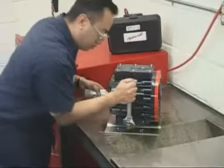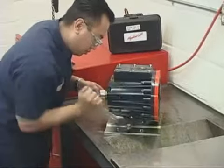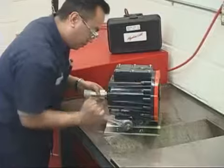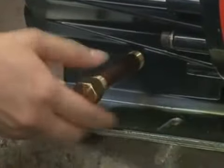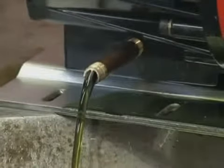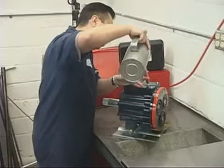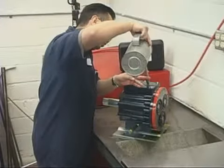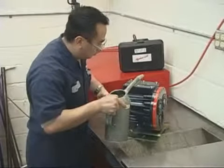To flush the contaminated oil from the hydraulic end of the pump, first remove the oil fill cap and the oil drain cap and allow all oil and contaminant to drain out of the pump. Replace the drain cap, fill the reservoir with oil, kerosene, solvent, or other appropriate fluid, then manually turn the pump shaft to circulate the fluid and drain.